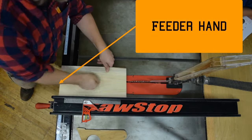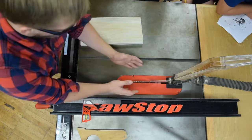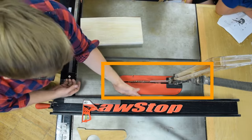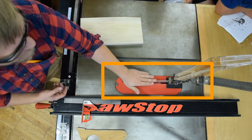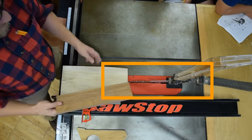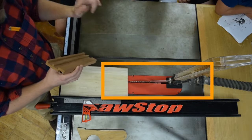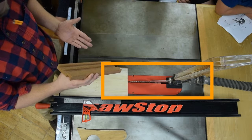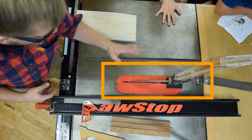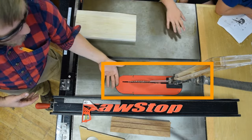This is my feeder hand, so it's feeding the workpiece through. Now, the rules of three: my fingers shall not be within three inches of the left, three inches of the right, or three inches above the workpiece. When doing a through cut as opposed to a groove cut — a cut with the grain is called a groove, across the grain it's called a dado — my left hand fingers should not go beyond the blade, and should not go underneath the guard.